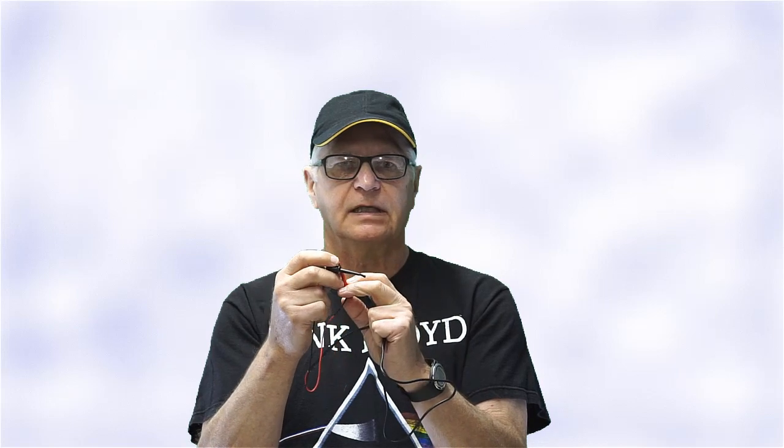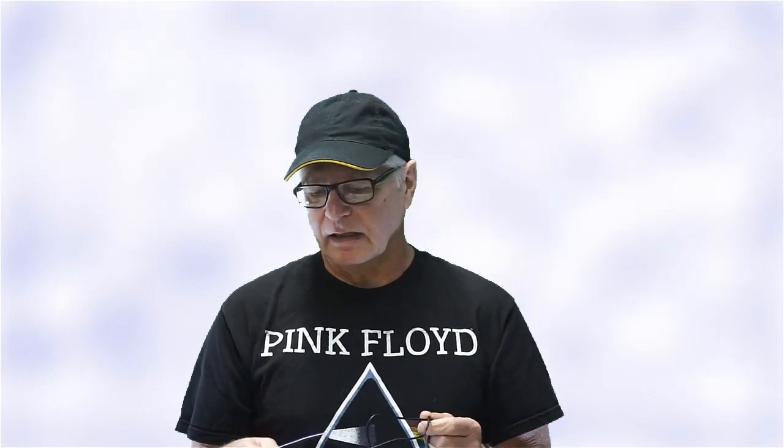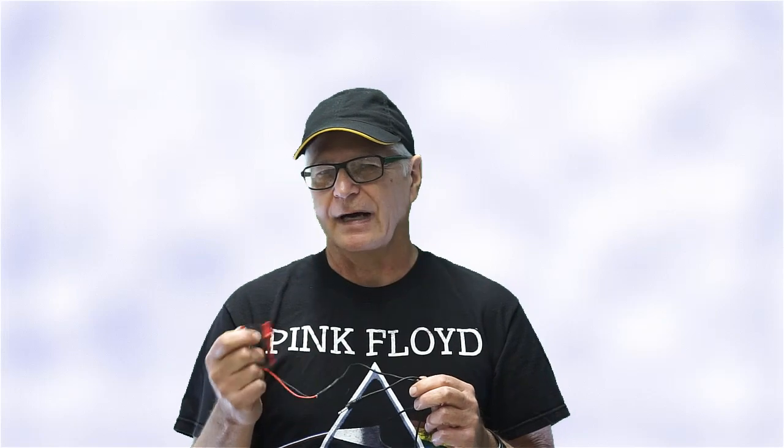The most common solution is to use small hook-style probes on the end. The entire cable maybe costs 75 cents a piece. I mentioned that I intend to make a few of these HS101 builds in that plastic case as personalized gifts, so I made four of these cables. The cables are easy and inexpensive to make and you can end up with a variety of styles — instead of hook-style connectors, you can have banana plugs or alligator clips.